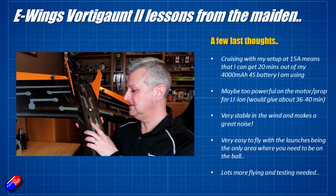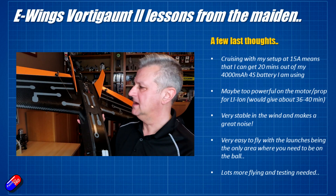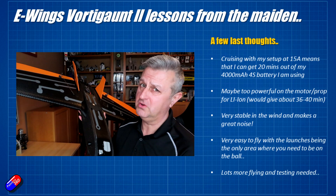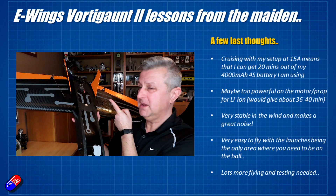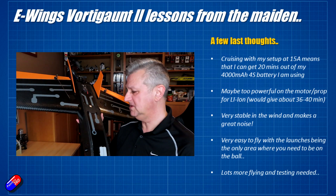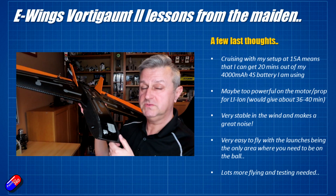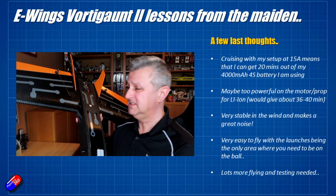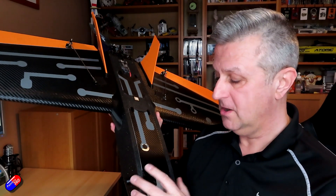Compared to the Blackhawk, this is an awful lot easier to fly and very forgiving. On that approach we just watched, I probably did the best part of 350-400 yards with the motor off, and she would have probably done another 100 yards easily without me pushing the nose down. The only challenge is the launches — if you're manual, 5mm of up tilt on your elevators, full beans, throw it, you'll be fine. If you're using iNav, full beans and make sure you have about 8 degrees of nose-up tilt so the neutral position is absolutely right. This is lovely — another cracking model and a really good diversion from everything going on over lockdown 3.0.